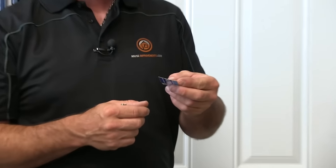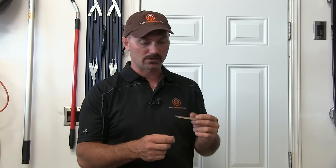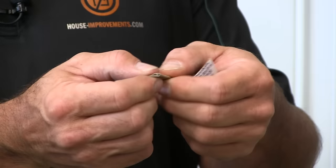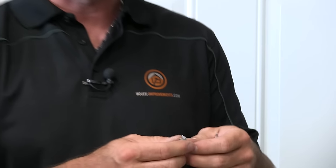And it's really pretty easy. If you've just installed the door, the easiest thing to use is actually the cardboard that the hinges were in. If it's an interior door, usually the hinges are packed separately. But basically all you want is just some really thin, basic cardboard. You don't want it too thick, just some packaging off of some kind of product. It depends how much you're going to shim — in this case, we're going to use about three thicknesses. So I cut it to this size, then fold it so it's three layers thick.